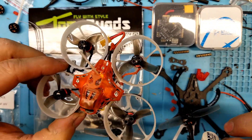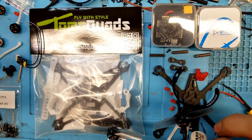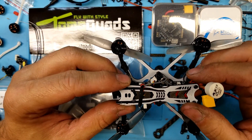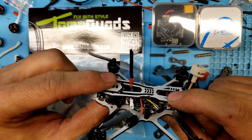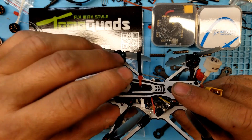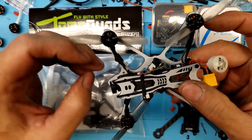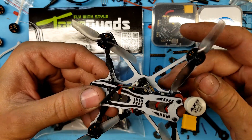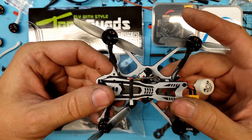Whoops don't come with a top-mounted battery, and therefore toothpicks didn't either. So what I want to do is create one that is 45 grams or below. This one here came in around 55 grams. The difference between 55 grams and 45 grams is a 20% weight difference — a lot less weight for these little tiny low-torque motors and these little tiny bendable props to have to haul around.